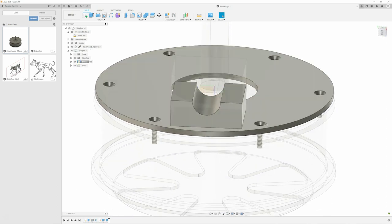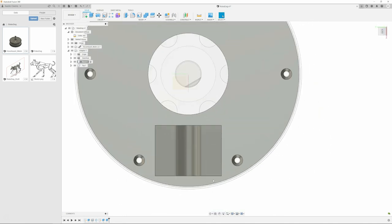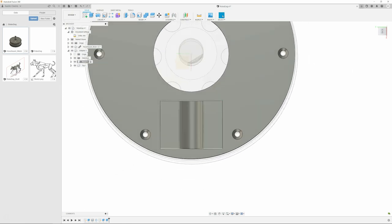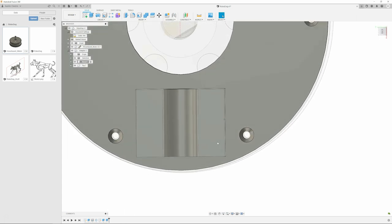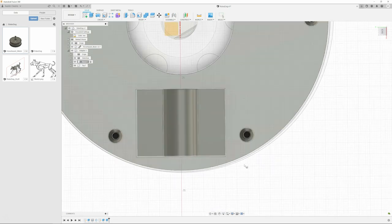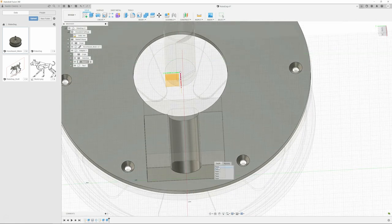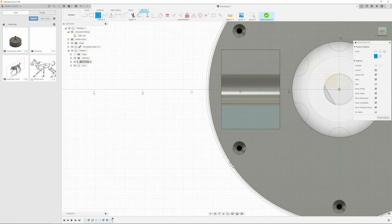What I'm making here for the adapter is just a prototype - it's going to be made out of plastic right now just for prototyping. I do not at all intend for that to be the same going forward; it's going to be made out of metal. Everything's going to be like that for the first article at least. I even did 50% fill because I wanted to go faster.